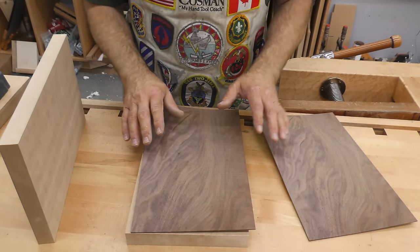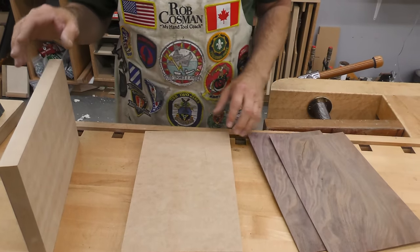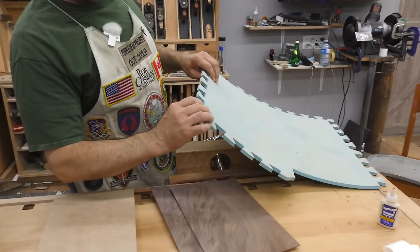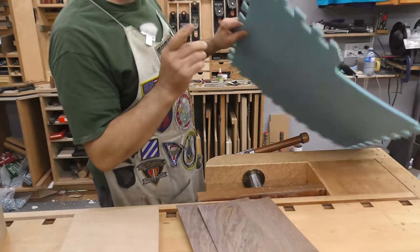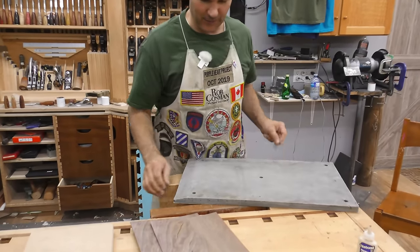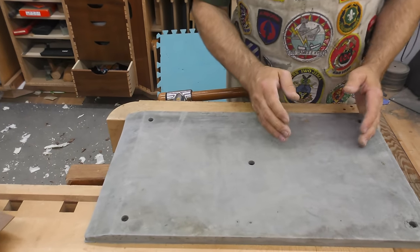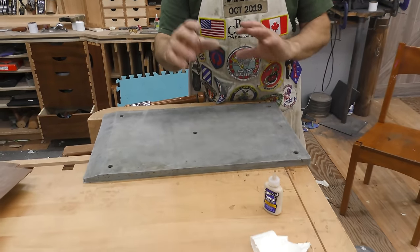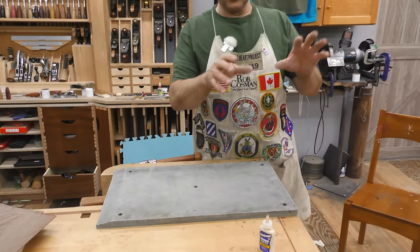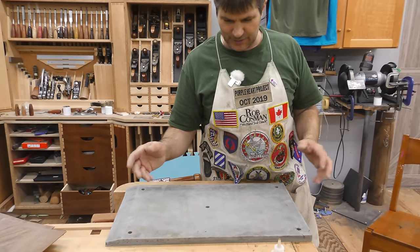When I first started doing this, you used to be able to get kitchen flooring with pretty rigid foam underneath that would bounce back and not stay compressed. I would cut it up and lay it so you'd have: caul, piece of foam, your veneer piece, another piece of foam, and the other caul. Then when you put pressure on the cauls, that cushion would even the pressure out over the entire surface. Well, can't get that stuff anymore. Now I have foam on my floors just to walk on — that's not bad but it's not as strong as I'd like. We're actually in an old bowling alley. When we took this place over they had this rubber installed where the pins sat so the balls would bounce around. It measures three-quarters of an inch in thickness and it's really stiff but there's a little bit of give — so I'm going to cut up two of these pieces, one on either side, and I think it'll do the trick.